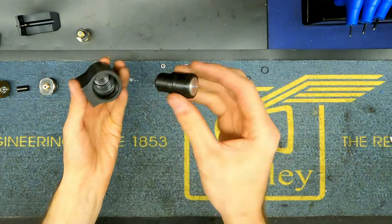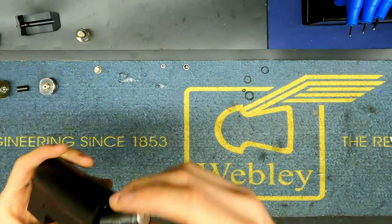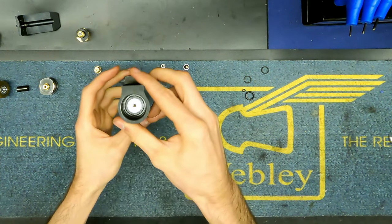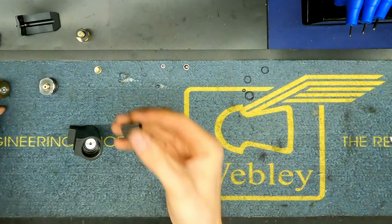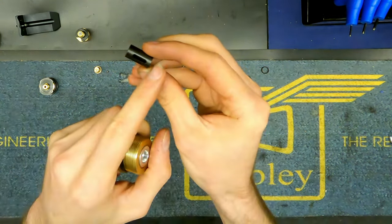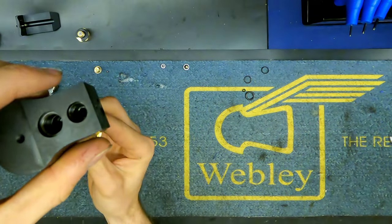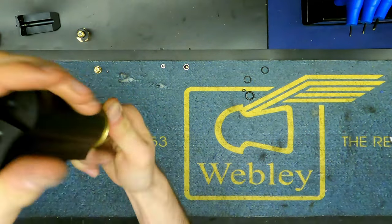Okay, so next we're just going to pop that regulator back into place. Just drops it into the back there, silver side up, and slot it into position, just clicks down there. Then we can put the main valve back on. So that spacer sits on that side. This side here is slightly shallower than this side. Longer side sits there. And I tend to just hold that upside down, just to make sure that that doesn't rattle around until it's sort of in position.